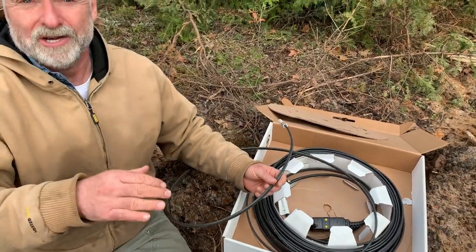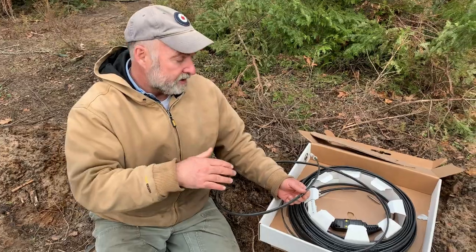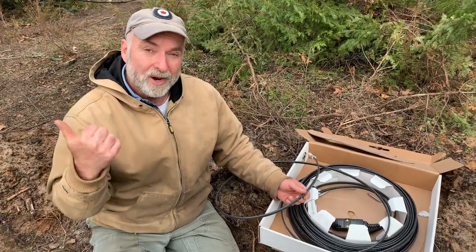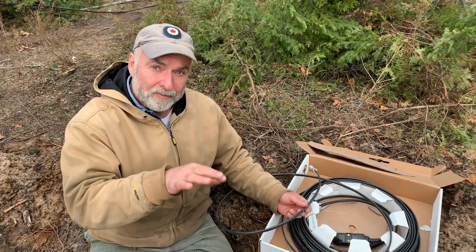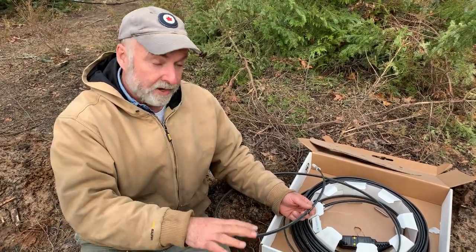The cable can't completely shut itself off, so in the summertime when there's no danger of freezing it would still be using some electricity. That's why we're going to couple the installation with a thermostat that has a probe that goes right next to the pipe and controls the flow of current to the system.